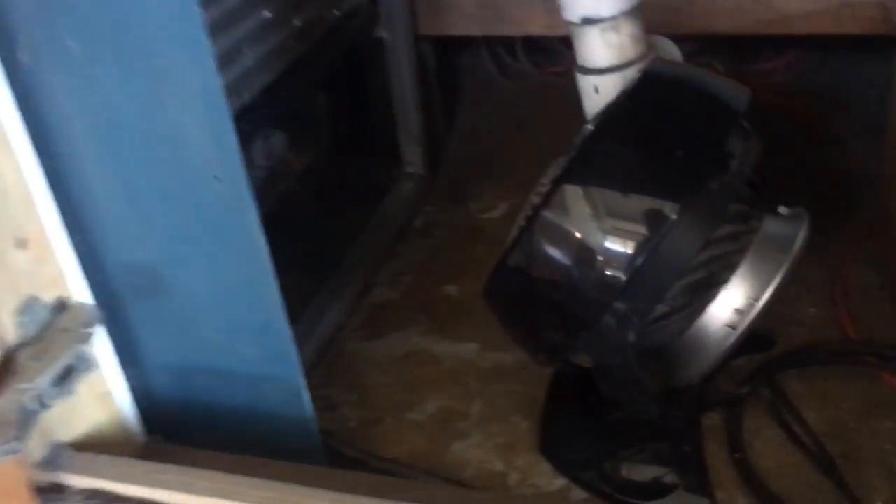Let's see if I can get this panel off. We can take a look. So you can tell this thing's going to have a high head issue. We got a great fan here. You can see the heat exchanger on the tubes. And the coil doesn't look that bad if you're just staring into it, but it's totally compacted.